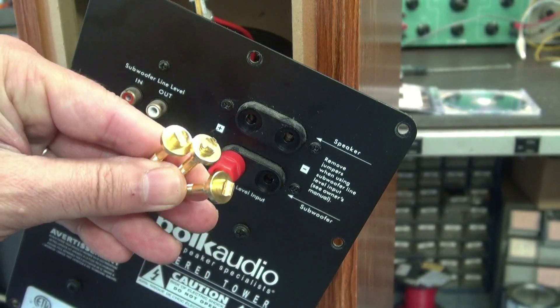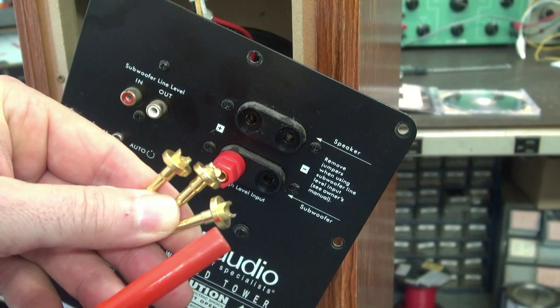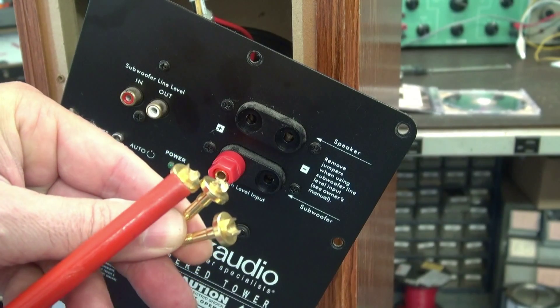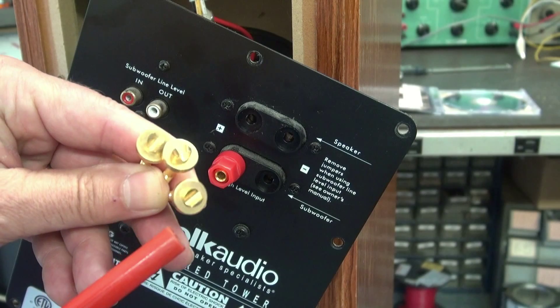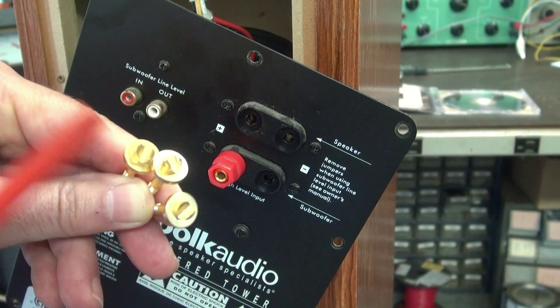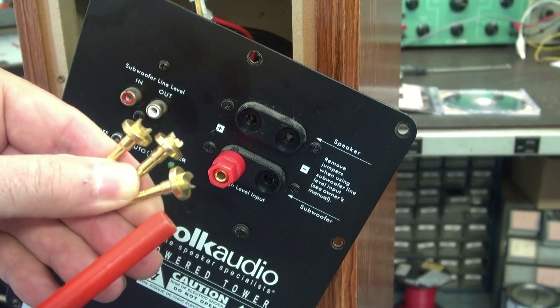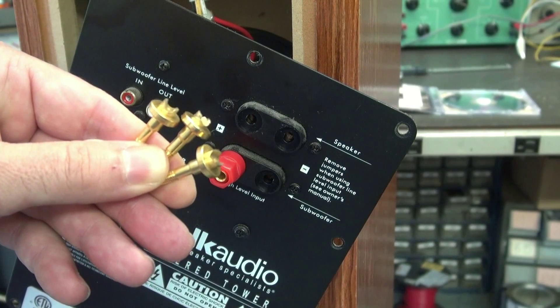Here are the jack pieces that were left in those holes. Since I want to retrieve these hubs to mount my new jacks, I'm going to take these on my milling machine. I'm going to remove this damaged area so that they're flat, then drill them out so I can pop these hubs off and they're going to go on the new jacks.